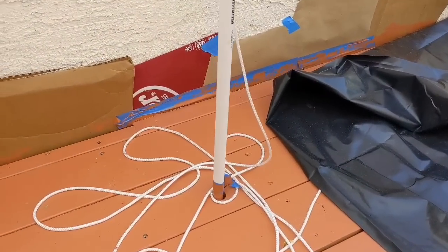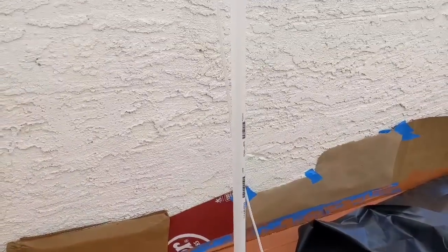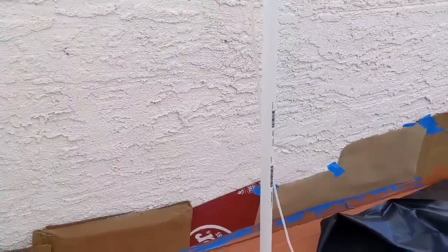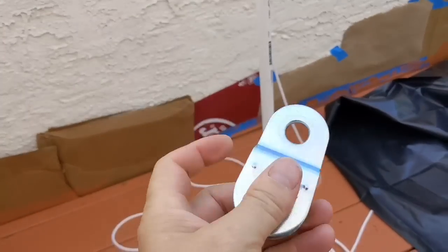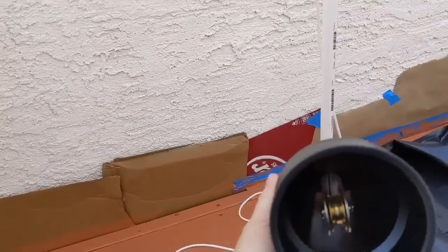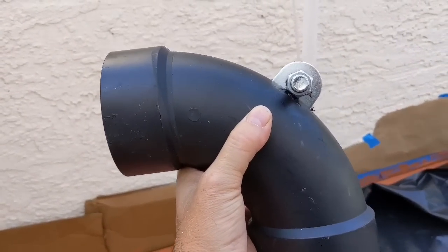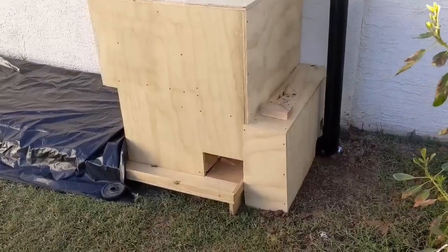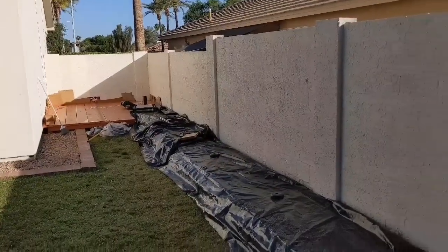Making a quick change: I've shown how I bent these PVC pipes with a heat gun to get a soft curve hoping to not need pulleys — I've now gotten to a point where I think I need pulleys. I came up with what I think is a pretty clever solution. I'm switching the pipe underneath and at the ends to a three-inch pipe and I bought pulleys from Home Depot that have an awesome hook on top. I take a three-inch pipe, cut a slot in the back, put the pulley in through the slot, bolt it in place, and now I can run my cord around the bend in a pulley. All four turns are now run by pulleys — one down in the ground, one at each bend, and back at the start where it bends up to where the crank will be.